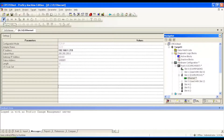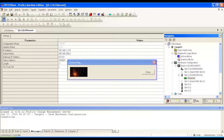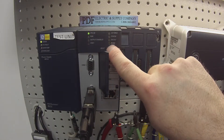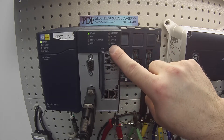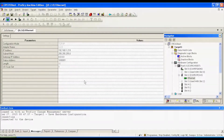In order to do that, I want to click the online button to get the processor to connect to the software. That's the lightning bolt icon in the upper left-hand side. Once it is connected, I'm going to toggle online mode. I also noticed that the COM2 port is blinking while I'm doing this, which means that the COM2 port is, in fact, working. You can tell both by the LED blinking and by the software connection.